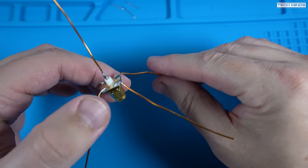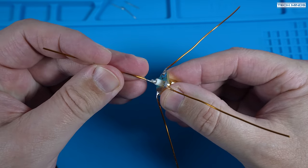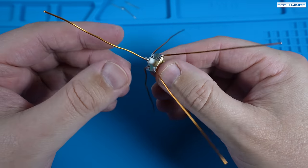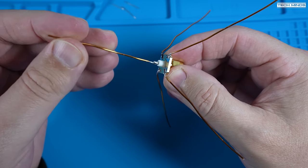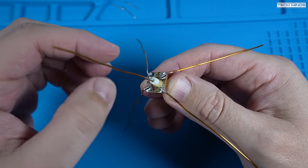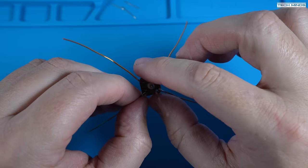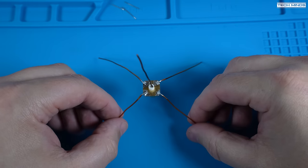Now, one of the key components of setting up a system like this is the antenna. This is because those ADS-B data bursts are transmitted on 1090 MHz — that's 1.09 GHz. Don't let this put you off, because making an antenna for this frequency is a lot cheaper and easier than buying a ready-made antenna.